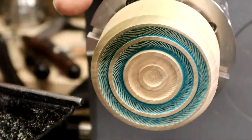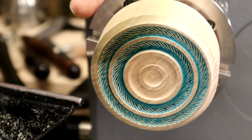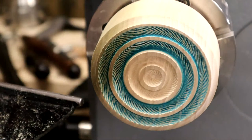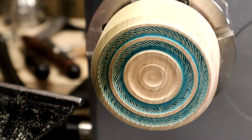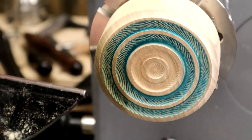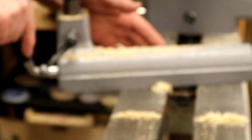We could go with some lime and wax. You could spray it if you've got your airbrush. Black dye would be fantastic. The airbrush is quicker drying, which is the thing that kind of puts me off with the brush this morning. You could lime and wax it, wipe off the excess. It shows that up beautifully as an effect. Okay, so adding colour can be good. If you do something like African blackwood, it could be really good. You then use a gold or silver gilt cream. I've seen those done as well.